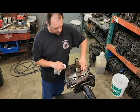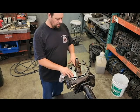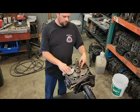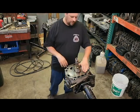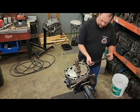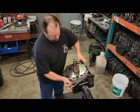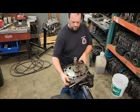In this case I'm just feeling for step wear right here. In some cases if the engine freezes, you have a floor right here in the center cast iron — when it breaks it'll push the floor up. This is the biggest pocket of water you have here on the center plate; it can cause it to fall out in the center piece.